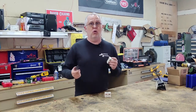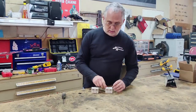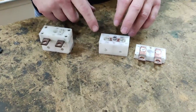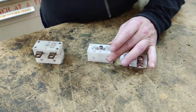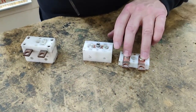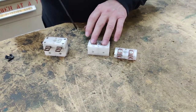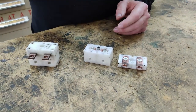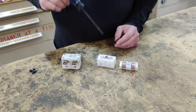You can't turn the robot more on or more off. Let's look at what it looks like inside. Here's one disassembled — take the top off. There are silver contacts that make your connection, and a big bolt that goes in and out raising or lowering that bar so it makes that connection. You bring it up until those contacts touch. Screwing it further up doesn't make it more on. When you turn the screw in and the bar goes down and pulls away from the contacts, it turns off. You can't turn it more off than off. Driving the switch all the way in either direction can break the plastic.